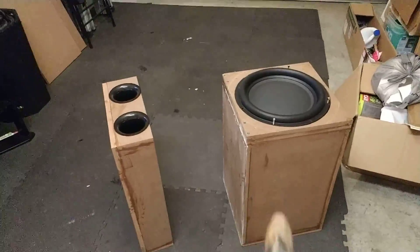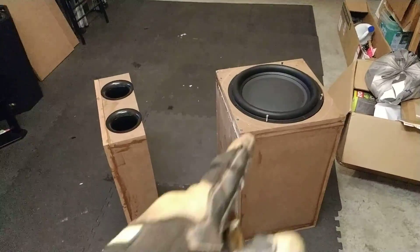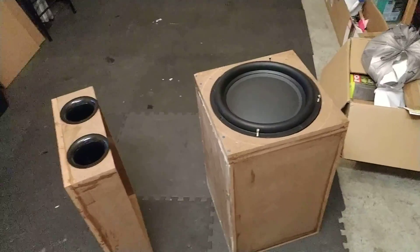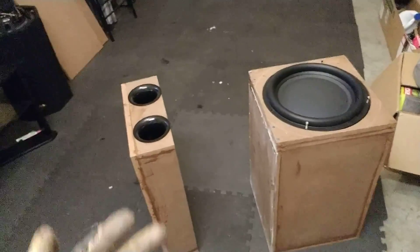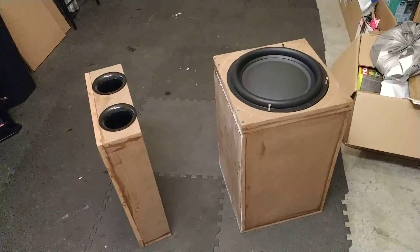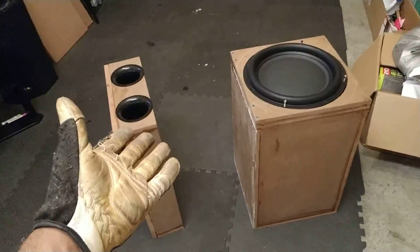In this case, this thing is a completely different world — it does not play to the same tune of those traditional circumstances. Because of the extreme and exaggerated measurements of this thing: it's a 15-inch driver with a 7.5-inch voice coil and an excellent BL rating. If you want to find out more, go back and look at the videos on my channel. In short, it performed just as well in a ported enclosure as it does in a sealed enclosure. So why am I going ported? Because it's more efficient — I can throw less power at it and get the level of sound quality I'm looking for.